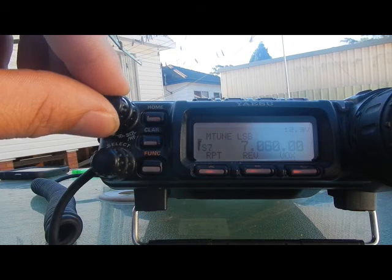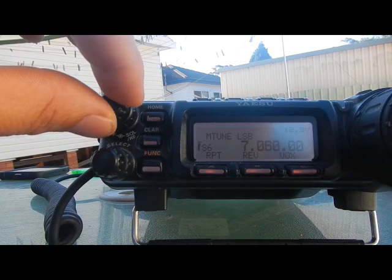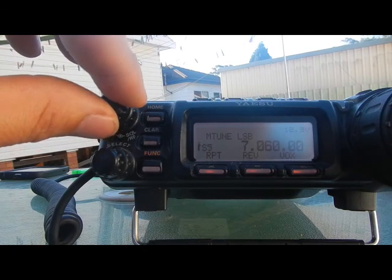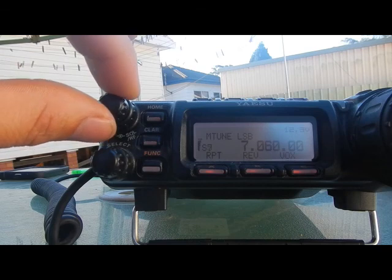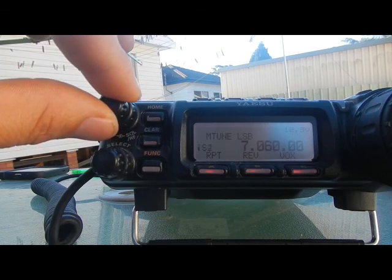Okay, again, what I was doing is I'd gone back over to the antenna and was having a bit of a play with that lead. It's obviously a lot easier to tune up when you've got a lower powered station or a station that's not coming through real good. When I was tuned up with the other fellow who was already an S8, S7, S8, it was difficult to hear any improvement. But when I was playing with that guy who was S1, S2 or whatever he was, I could definitely hear an audible improvement.